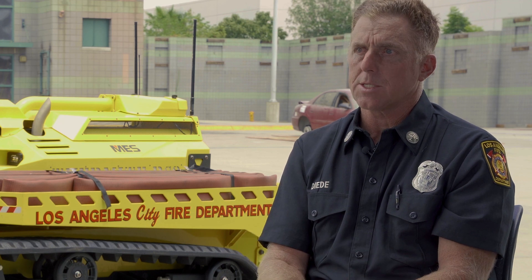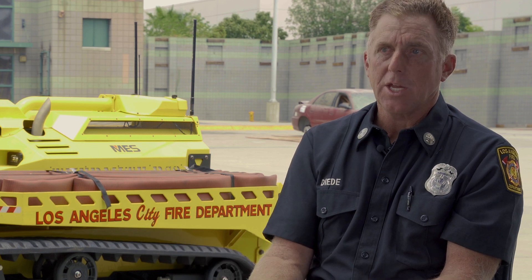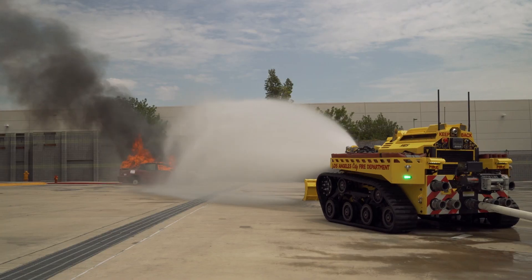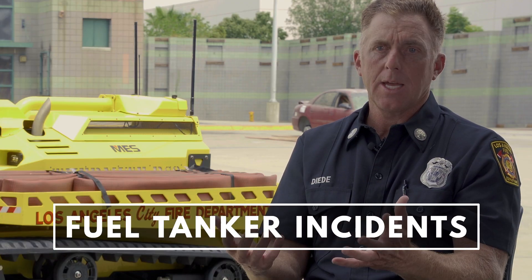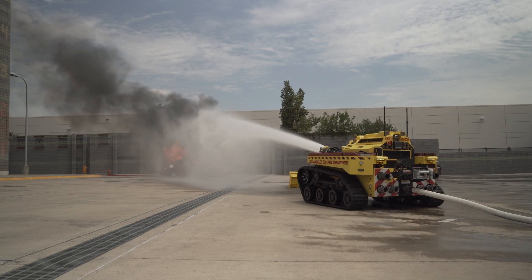What we're starting to learn is that the more you use it, the better it gets, because you're starting to make it do the things that you need it to do. A fuel tanker on the freeway that's burning — if that thing explodes and the rupture happens to have people right up on it, it's obviously not in our wheelhouse. But having something like this with a dedicated water supply that can put 2,500 gallons a minute on a fuel tanker threatening a BLEVE of some sort just gives you every opportunity in the world to keep your people safe.